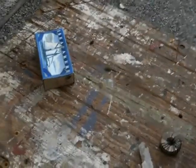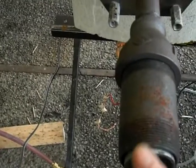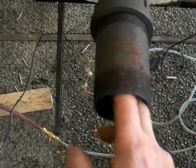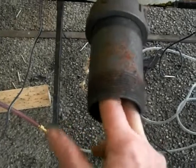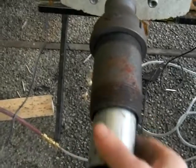So we're going to test out these pipes. This here is just more or less some baking aluminum foil. What I've done is wrapped it around the pipe here as a filler. What I want to do this time is insert the drill pipe into here all the way back, so none of the propane is going to get out. The air and the propane are coming through here, and the reason to insulate it is not just to hold the air and propane in, but also to act like a buffer — you don't want metal to metal.